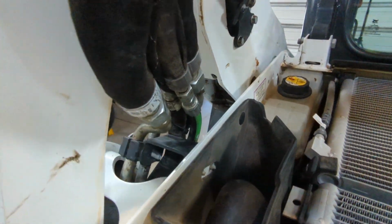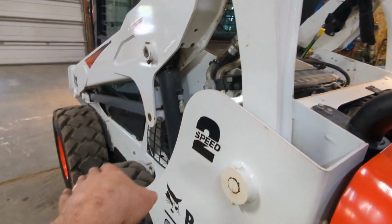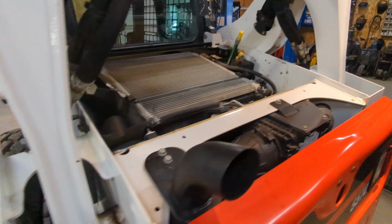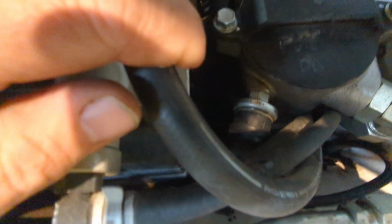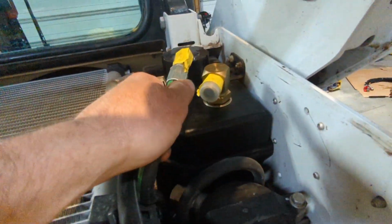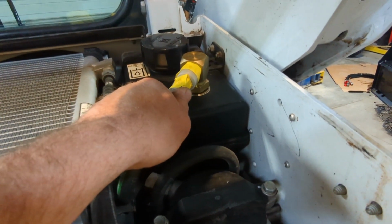my new hose that I made down underneath the loader arm assembly, because this machine has the vertical lift, so there's a little bit more moving parts versus the machine that just has the radius arm lift. We took that and came out up there by the tank. So I came down, zip tied it to keep it away from the exhaust, weaved it through there, and back up in there, there's a little bit of a hole or opening, and it came out under there, ran it up right here, and I just have to put my 12-6 adapter nut on and connect it right there.